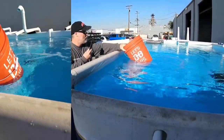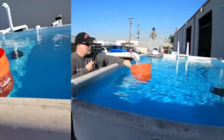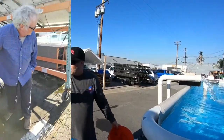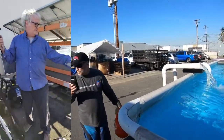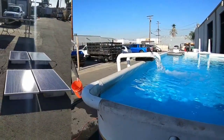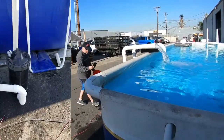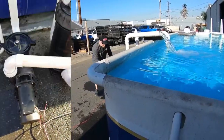And go — counting about six seconds to fill the five-gallon bucket. Maybe a little slower, about six seconds. Six seconds is still 3,000 gallons an hour. Part of it is the panel angle. Right now we have it on four 100-watt solar panels with our Sunray half-horsepower solar pump and Advantage Manufacturing cartridge filter. You can't hear the motor spin — it's absolutely silent.